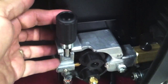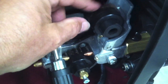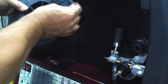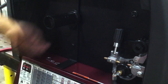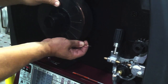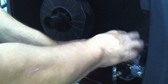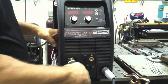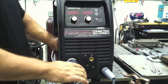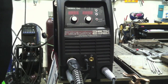A brief overview of the guts and inner workings inside the cabinet — this is the ThermalArc. It's got gear-driven drive rollers where both rollers actually have a drive force behind them. I'm loading some .030 ER70S-6 wire. I'm going to use the same spool of wire on both machines. This is how it feeds through the feeder mechanism, held on by a little pin. I'm just working on plugging in the MIG gun, getting the control plug plugged in and getting set up for MIG.